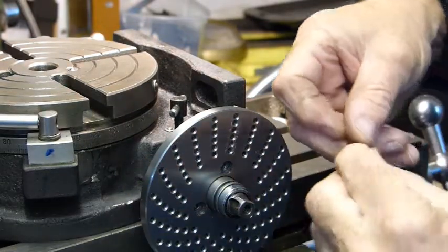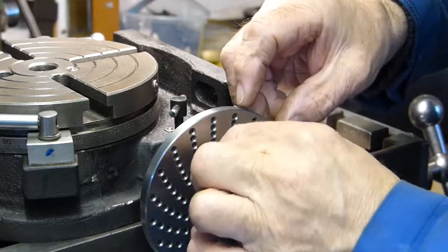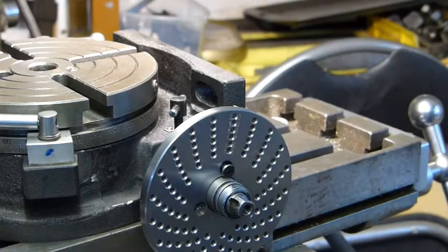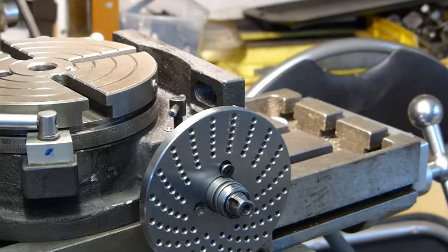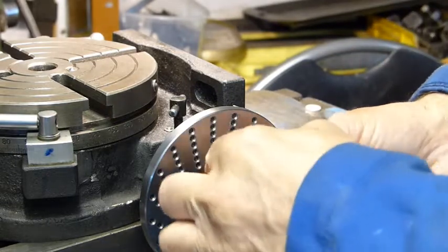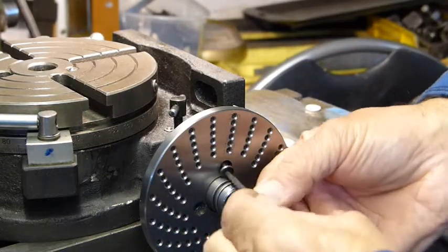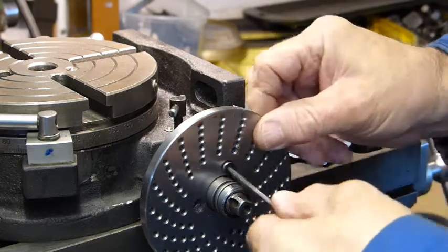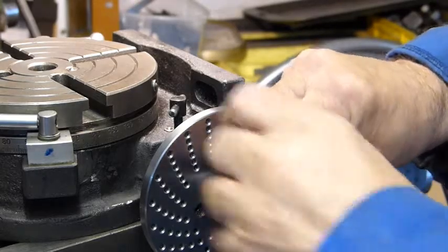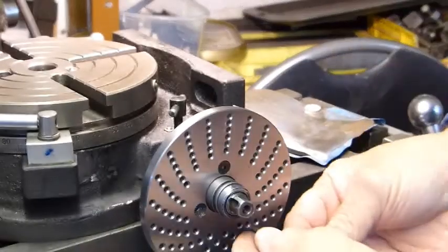The plate goes on fine and the screw holes all line up. I attach the small countersunk socket head screws. The original problem with the shaft flats — as mentioned, they were oversized, not by much — I could have filed them, but it was easier to put the whole lot in the dividing head I currently use and remachine the flats. That way they're equal and it panned out okay.